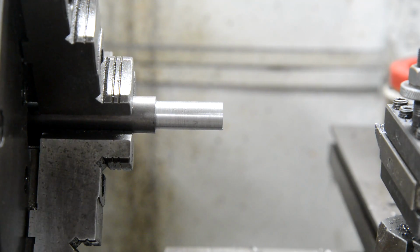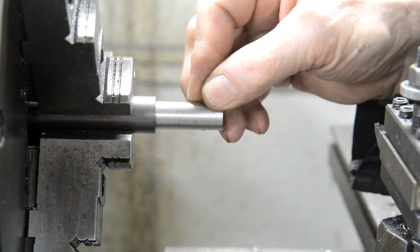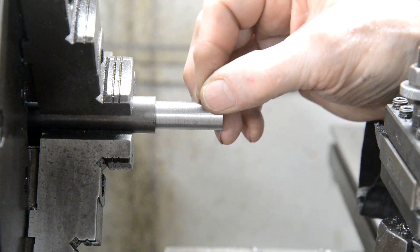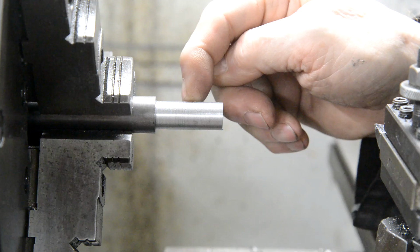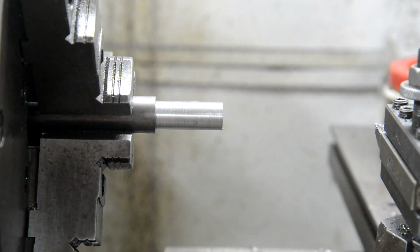Here's just a little bit of information for you. I'm getting my trials bike ready to paint, and I've got half the frame stripped down. So I was able to measure a couple of tubes where I've got the paint off part of the way, and where there was still paint. And it would appear that epoxy primer and then colour mixed in with clear coat gives me about 16 thou on that. So I'll take about 15 thou less. So instead of 500, I'll make it 485. Don't forget to keep an eye on my maths for me, people, and just shout out when I get it wrong. So there's just a bit of information for you. You could say roughly that your paint is going to be between 10 and 20 thou thick on a tube.